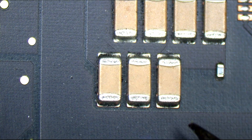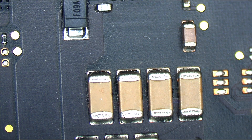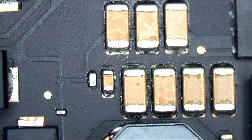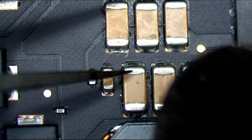We're going to take a look at the underside of this MacBook, and we have more caps, but these ones don't have solder balls next to them. So the first thing I'm going to do is remove those capacitors that had solder balls next to them, using the quick hot air station available at store.rossmangroup.com.